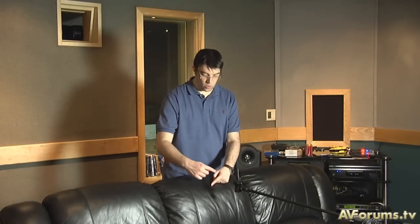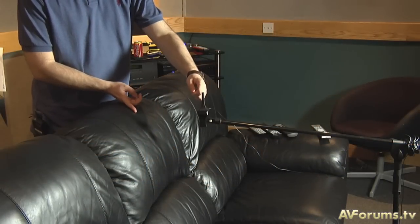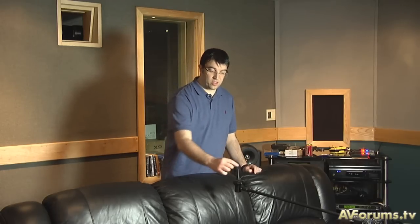What you can see is that we have approximately 30 centimetres of space between the microphone and the back of the chair. That value may seem like a lot, but remember the resolution that you have for setting channel delays in your AV processor is normally going to be around 20 or 30 centimetres. That type of distance is not going to have any impact on the results other than a positive impact.